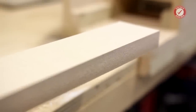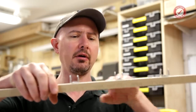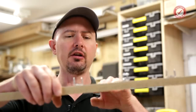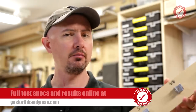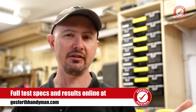It's simply because of the structure of MDF. MDF is made in layers effectively in the production process — the fibers are all orientated that way, which is why it's more inclined to split along the edge grain. So I'm testing into Trupan non-MR MDF here, 18mm MDF — a really common size and type used for cabinet making, cabinet doors, and all that sort of thing.